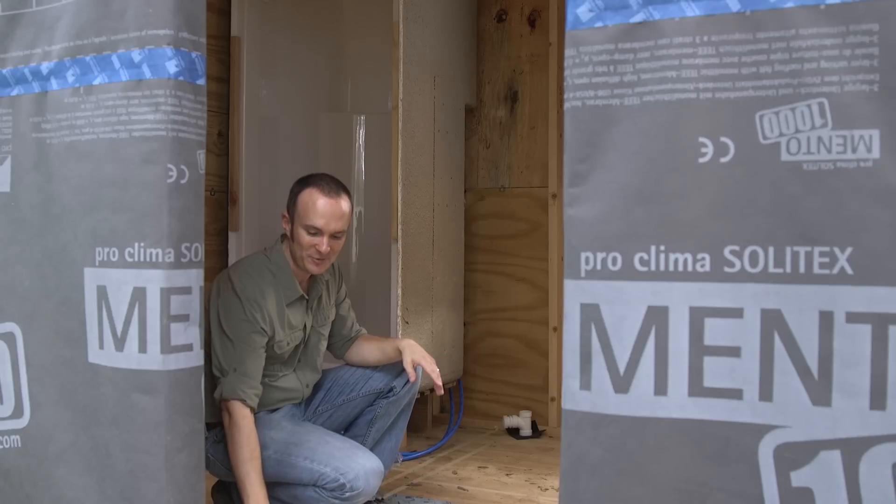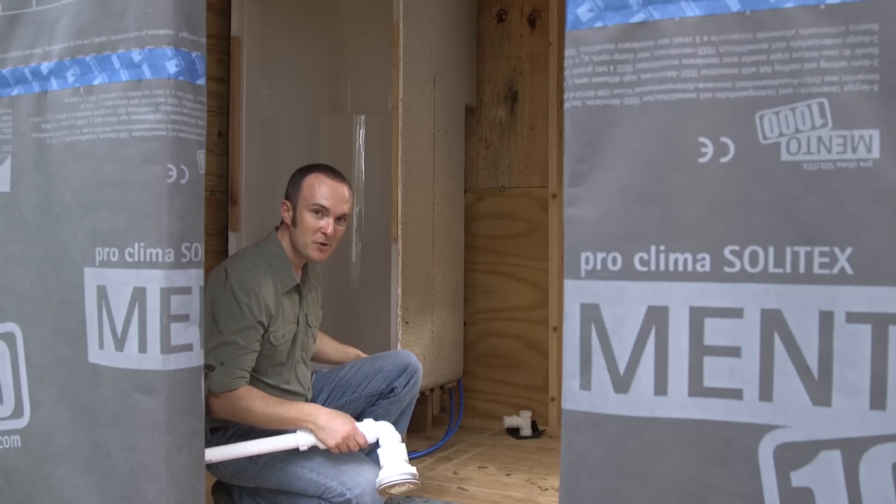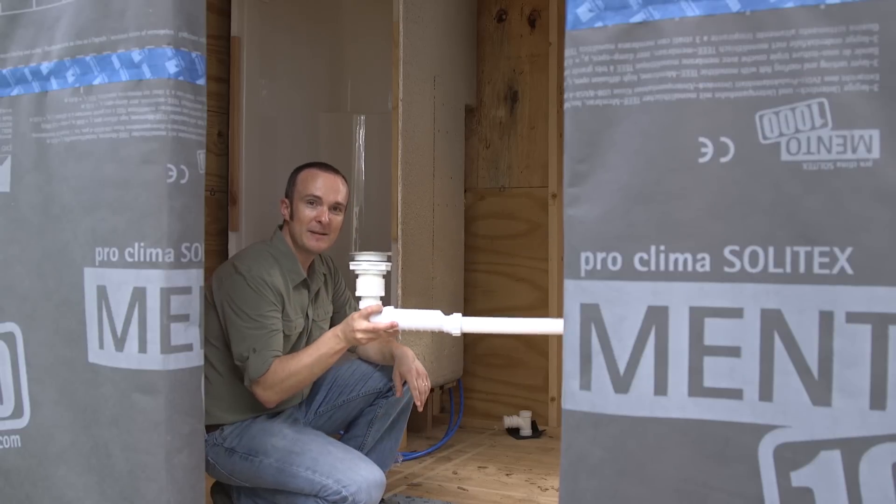We raised the shower because we built this floor into the deck of the trailer. Unlike a lot of tiny houses where you get the trailer and then build a floor on top of it, we wanted to save as much headroom as possible, so we built down into the trailer. That means I don't have room to run plumbing down through the trailer and work underneath it — which would be messy and exposed to road hazards, since this house is going to 20 cities in 2016. So instead we raised the shower up and this becomes our drain system.